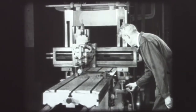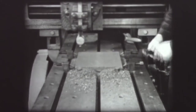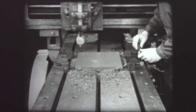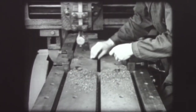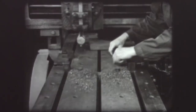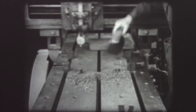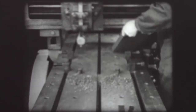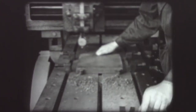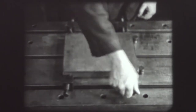The table is now brought to a stop and the motor is switched off. To prepare for the next cut, loosen the pins and remove the plate. When the working area has been cleared, turn the work piece over. Making both rough cuts first overcomes the effect of warping. In clamping the piece in position, again be sure it is firm against the stops.